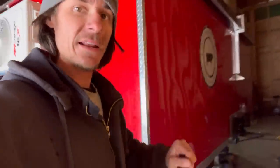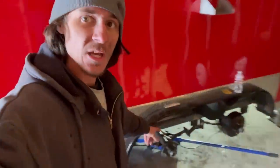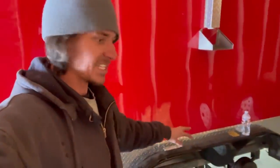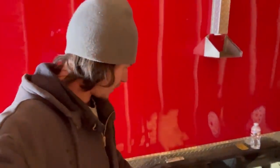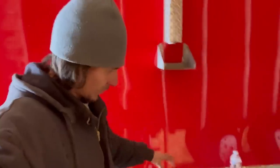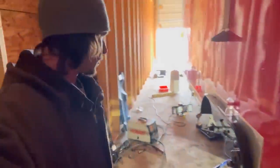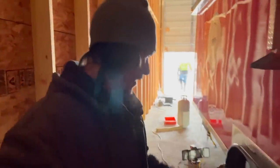Cool. Guys, that's it for this video. I'm not filming the other side. As you've seen, we got some pretty tight welds. I did a stitch weld pattern to reduce the heat input into that 16 gauge material that they made the frame out of. We scabbed in some 3/16. We used some flux core. We ran it about 140 amps, about 300 inches per minute, and it came out pretty good. We addressed some cracks that were on both of the axles due to grinder cuts that were never taken care of. Very interesting. And that's the whole show.